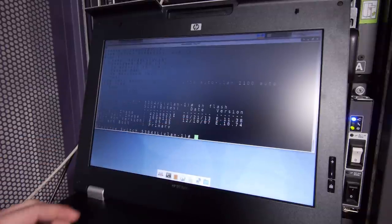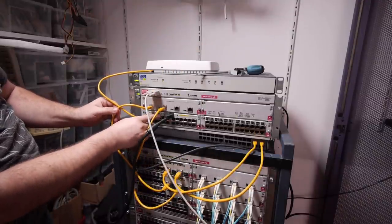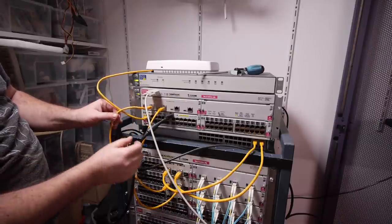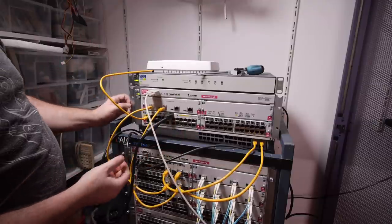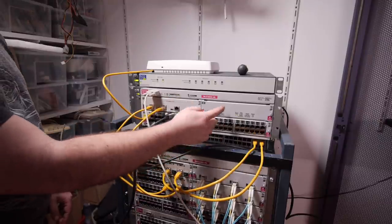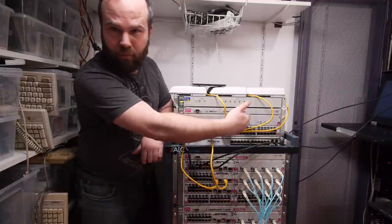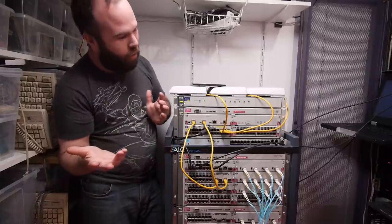Updating the firmware is super easy - the HP Procurve console commands are super easy to work with. David Bombal has a free full course on HP Procurve on his YouTube channel - a link will be in the description because he explains it way better than me. The access point is powered on over PoE and the light on the switch confirms it is working. I couldn't make a 2-gigabit trunk to this switch because we have only 4 gigabit ports and the rest is all 10/100, so the WiFi also communicates over 10/100 to the access points.